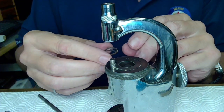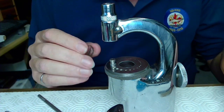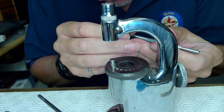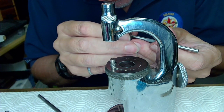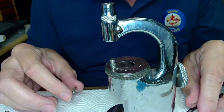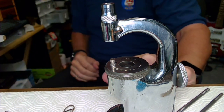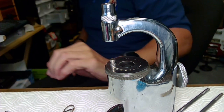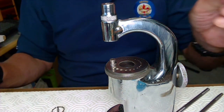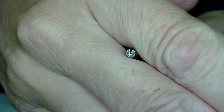I'm checking whether this stump is the right one — it can be a little smaller, and this one looks way too big. I want it to be as tight as possible but without interfering with the roller jewel. Let me get my flashlight out to find the right one. All right, I found it — the hole is pretty small.